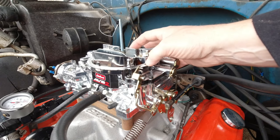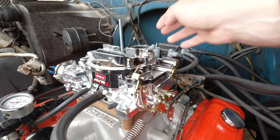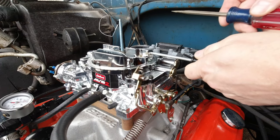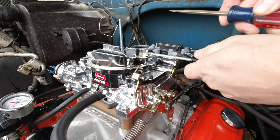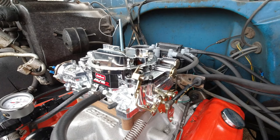A little less tension on the spring means the door opens a little bit easier and a little bit quicker. When you have that hesitation, always add more tension to slow the door down. If it makes it a little bit better, then you know you need to keep adding a little bit more tension.